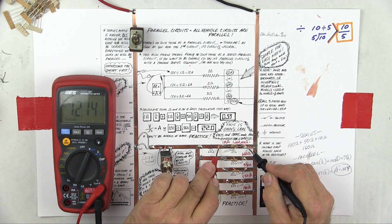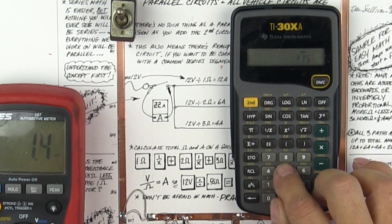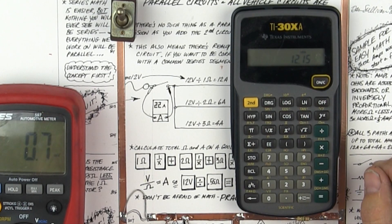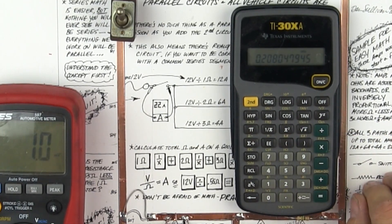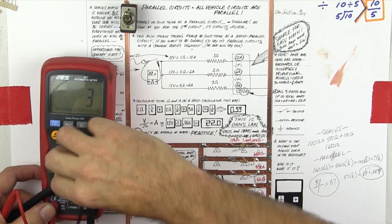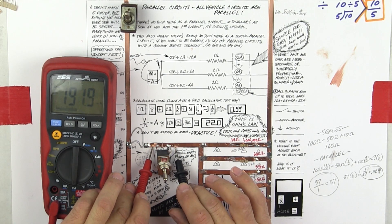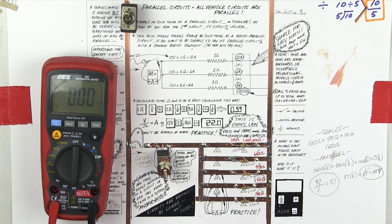Let me revise the calculation: 12.15 divided by 58.4 gives about 0.208 amps. Remember, every time you move these leads you turn the meter into a jumper wire, which can be dangerous on big stuff — so don't get careless. The reading is 191, we calculated about 200, and we're at 192 — so that's only about 5 or 6 milliamps difference. Among friends, that's not a problem.